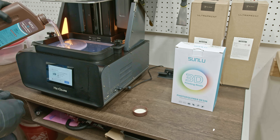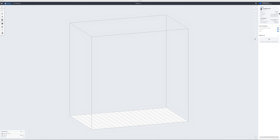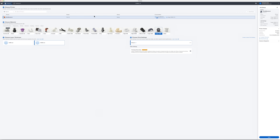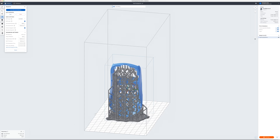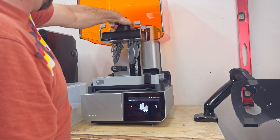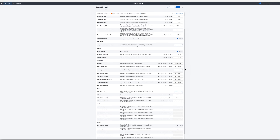And while it's built around Haygear's own resins, I've successfully used a variety of third-party resins with no problems. Then there's Formlabs Preform, which combines the best parts of Blueprint Studio and ChituBox into one seriously refined package. The printer links to your account during setup, so when you open Preform it already knows what printer and resin you're using — try to slice with the wrong resin and it'll warn you. Choose your layer height, usually between 100 and 25 microns depending on the resin, then import, orient, support, and slice. It's simple, it's reliable, and outside of the default support settings being a bit overkill, the results are nearly perfect. Preform offers more customizable settings than any slicer I've ever used — you can build full custom resin profiles with a ridiculous level of granularity.